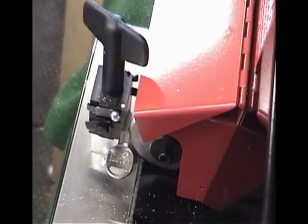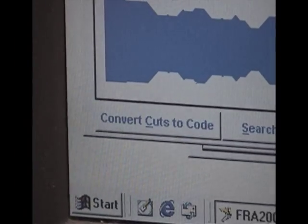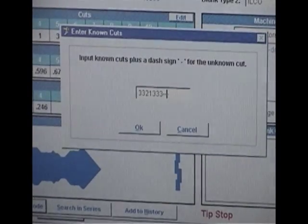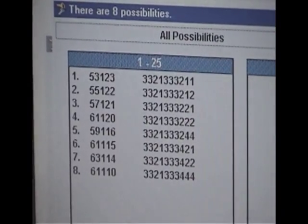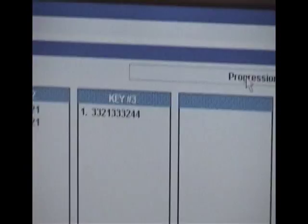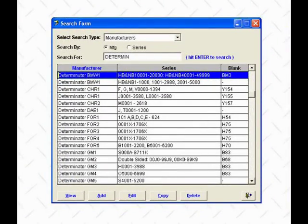This covers the basics of using the FRA-2001 machine. Next, we'll cover some of the advanced features. If you are a locksmith doing automotive work, the Genericode program and the FRA-2001 key machine are an excellent combination to make your work easier. At the key cutting screen, after looking up a key code, you can use the Convert Cuts to Code function to search for known cuts and develop a progression chart. Our version 5 software allows you to cut keys directly from the progressions page. If you use the Determinator tool to originate keys, Genericode now has a full listing of Determinators with the half-cuts already programmed in.